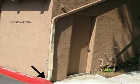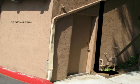Now, here's where I think the water problem is coming from, and that would be the downspout just dumping up against the curb when it actually should be going over it. It could just come down here and then go right into the street, which you would assume would be going safely away. But if that's not the case, it could always drain to the other side of the door. So it depends upon which way the site drainage is set up, which I highly doubt would be the case here. I would imagine that the water from the concrete sidewalks is actually going to be draining out into the street and then draining safely away to the city or municipal water collection drainage area.